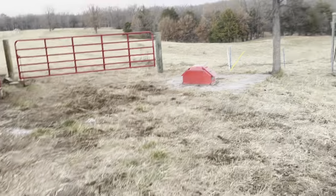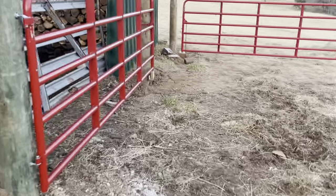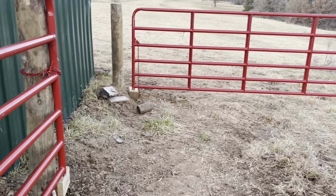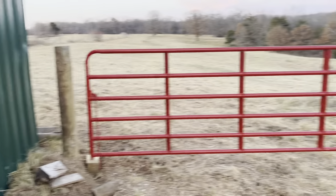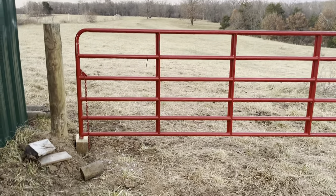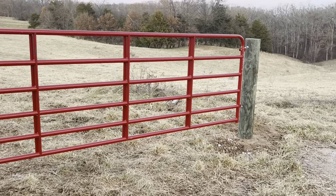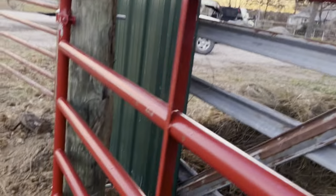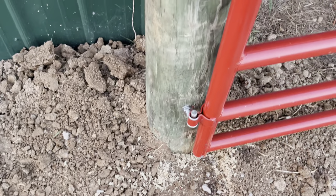It's coming together. Tomorrow we'll probably get all these posts set. We've got the digger that goes on the skid steer — it is run by hydraulics. Those are nine-foot posts, folks — you only see four-and-a-half foot of it. There's four-and-a-half foot in the ground. Anywhere we have a gate, on that end it's got two bags of sacrete. The rest we're using that inch-and-a-half minus right over there in that pile of rock, and we're tamping it. This post is like a tree.